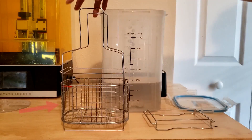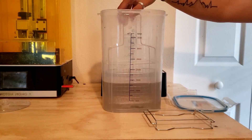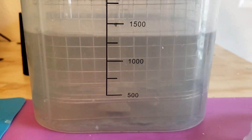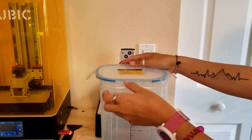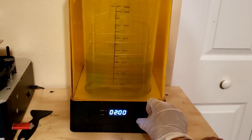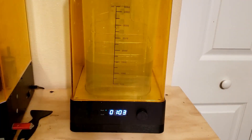The second wash method is using the wash basket, which can hold parts up to 120x74x165mm, or 4.7x2.9x6.5 inches. In this case, parts must be removed from the build platform and dropped into the basket. Regardless of which method you choose, ensure the entirety of the print is submerged in the cleaning solution before you start washing. Once your print is in the washing container and it's sealed, replace the UV protective cover and select how long you'd like to wash your print for — you can set any time up to 60 minutes. Once it's done washing, the machine will beep.